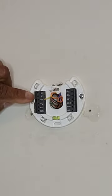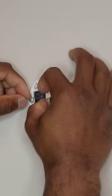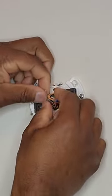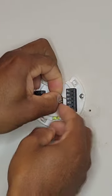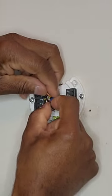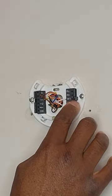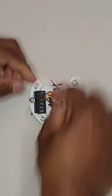Once you plug the wire in, you'll notice the tab goes downward — it folds into place to connect the wire. If I try to pull the wire out, it's connected. To unattach, just lift up. That's the Y wire, which is our yellow wire. Now the white wire we're going to put into W. The tab will automatically go down, showing it's locked into place. Then we take our blue wire and put it into the C position.